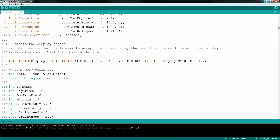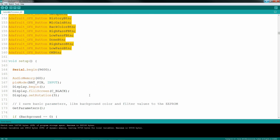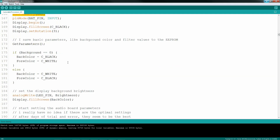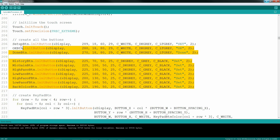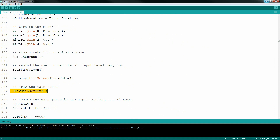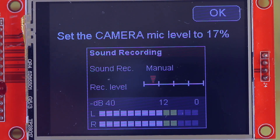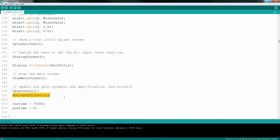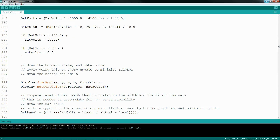Then I'll have a few more variables for various things: brightness levels, history, button locations. I'm using the keypad control right out of the Adafruit libraries with very little modification. I'm still new to these audio boards and I really don't know if I have the audio memory set properly, but it seems to work. One of the first things I do is get parameters — that makes a call to a function that retrieves all the data out of the EEPROM, like background color, foreground color, and filter settings. The settings I use here tend to manage noise levels very well. I initialize a bunch of buttons for OK, filters, and filter settings, and there's a cute splash screen and a reminder screen to let me know what the mic level has to be set at in the camera. Oddly enough, it has to be set very low, otherwise the microphone tends to overload the camera's input.